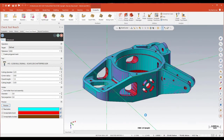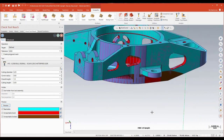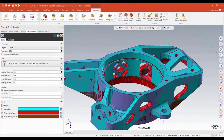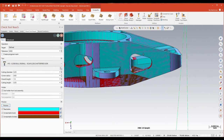Based on this plane and this tool, this is everywhere this tool can and cannot reach — it's not going to be able to do undercuts, but it's letting me know exactly where it can go and clear without violating the part. I can also check against the holder itself if I've got an assembly — a tool and a holder. Re-previewing with the entire assembly, you can now see based on the tool and the amount of stick-out: blue where it can go, red where the tool can't reach, and then a brown color showing where the tool can't reach based on holder violation. So it gives me a better idea — I can't go any deeper than that brown area; that's as deep as it's going to be able to go.